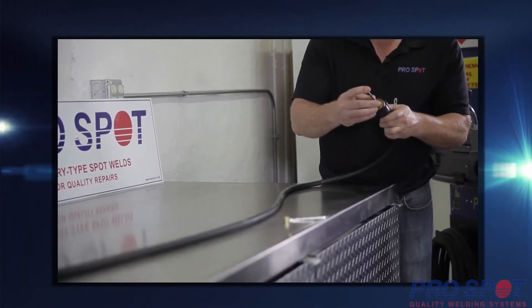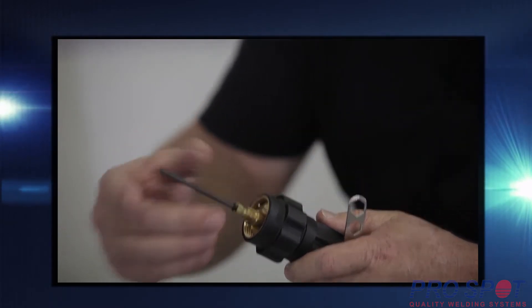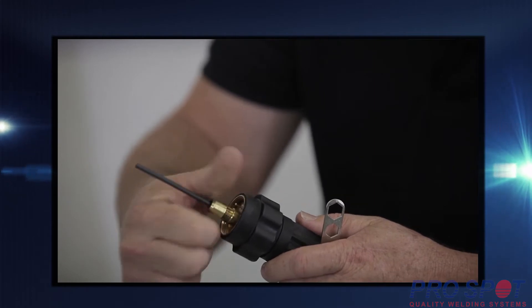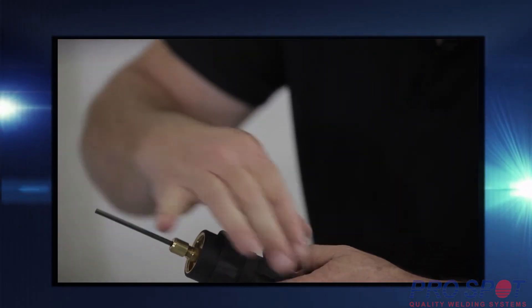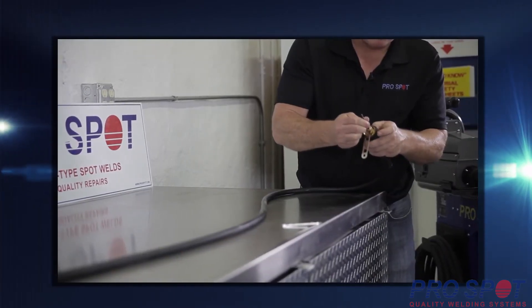Return to the rear and push the liner in tightly. Insert the collet and push down the rubber O-ring. ProSpot recommends screwing the nut down until it stops. If the nut is too far out, the gas line may not make contact and cause air seepage. A tight connection from both ends is desirable so the two-piece liner cannot come unscrewed.